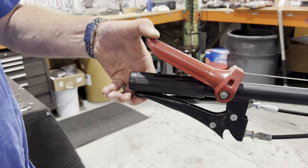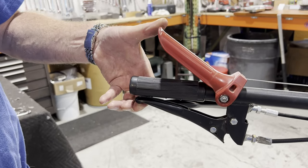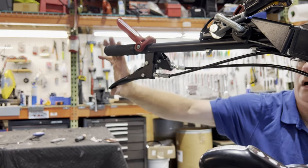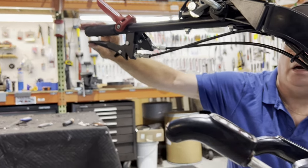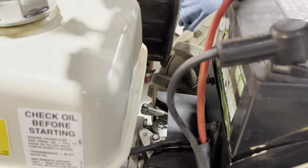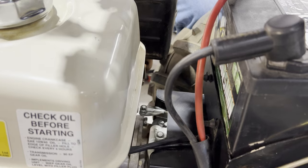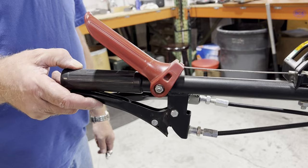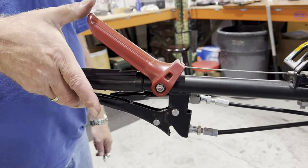The symptom that the clutch cable has stretched and needs adjusting is that after squeezing the clutch lever, the OPC lever cannot be lowered. For safety purposes, the two controls are sequenced so that the clutch cable with the large eyelet needs to partially engage the OPC control next to it before the OPC lever can be fully lowered. Consequently, adjust the clutch cable if the OPC lever cannot be easily lowered.